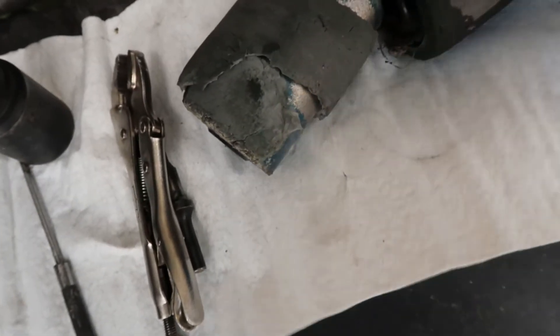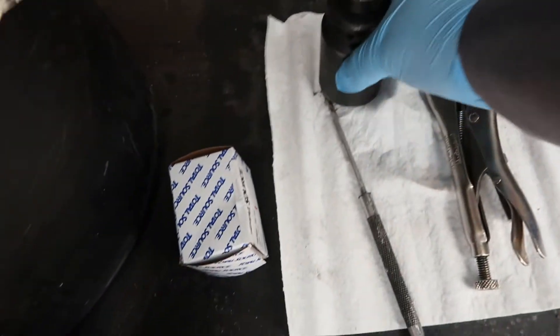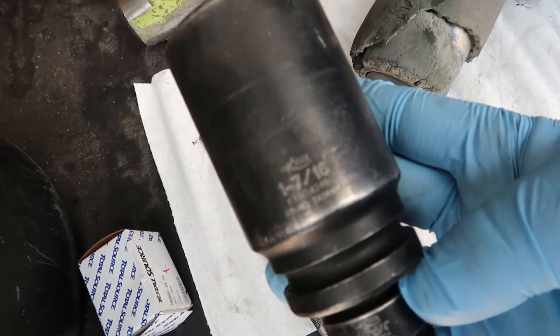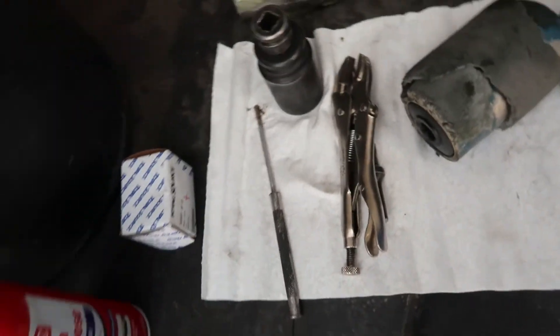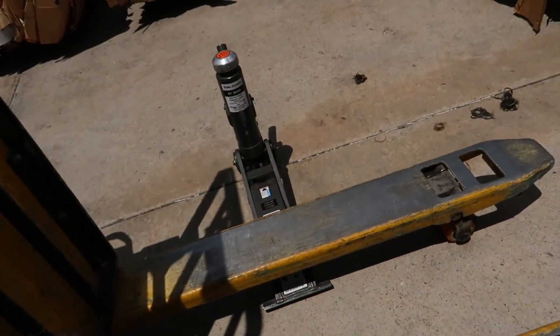The load wheels on this jack — you can see these things are pretty trashed out. To install the bearing, use your hammer and get as close as you can. I used an inch and 7/16ths socket and that fits perfect into the wheel onto the bearing — I smacked it in with that. One more thing I forgot to mention: you will need a jack, just to jack it up enough to get the wheel out of the axle.